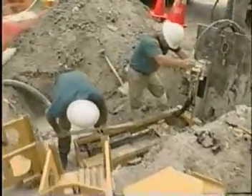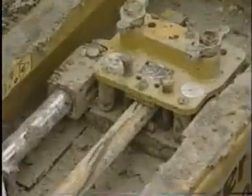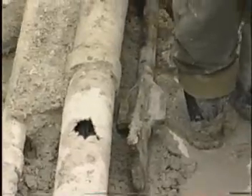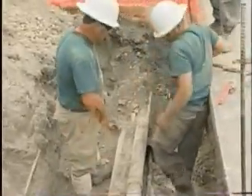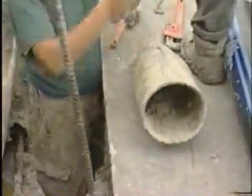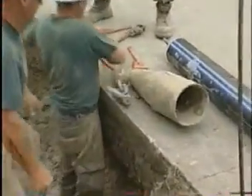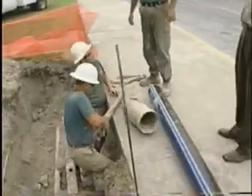What we're going to do now is screw the next rod in so we're all hooked up, and we're going to go to pit B at the other end of the job and hook up the expander and the splitting head to the HDPE so that we're ready to go. Basically what we've got on the end in pit B is our rods are through. We are now attaching the splitting head to the rods. Once we have the splitting head screwed onto the rods, we'll pull that back into the pipe slightly, then attach the expander and our pipe to the expander.